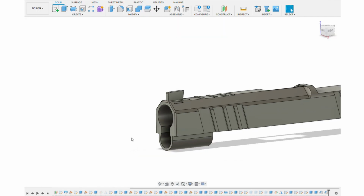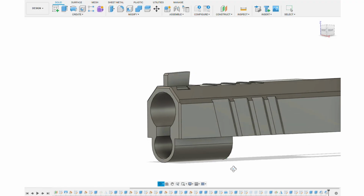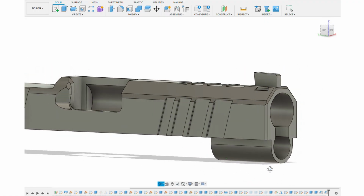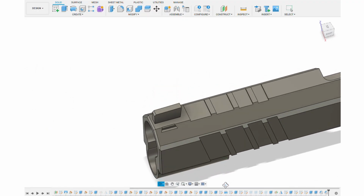I also modeled up my muzzle bevel. This slide has a little strip of a 55-degree angle between the 45 and sides. I wasn't going to do that little bit by hand or try to machine it, so this is what they're going to look like. 30 thousandths by 45, just large enough to take away that dent I put in the front of the slide from dropping it in episode 1.